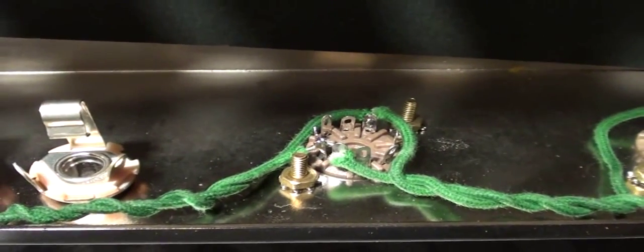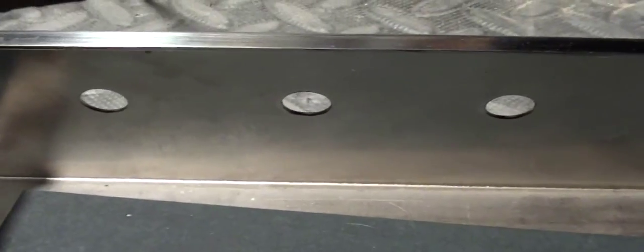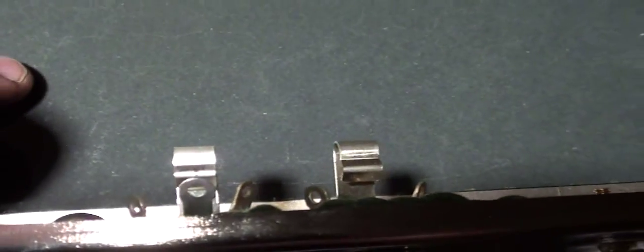From here I'll be able to work a little more easily with the leads coming off of the board when I actually get to it, which will be the next step once I install my components to the top side — the volumes, tone, and input jacks. What I'm going to do with my backing board is use double-sided tape to attach it in place, and that'll create a barrier keeping any solder joints and wires from touching any metal surfaces of the chassis.